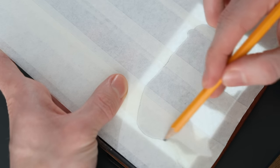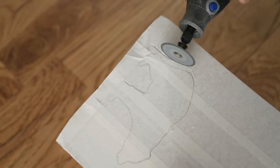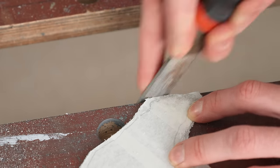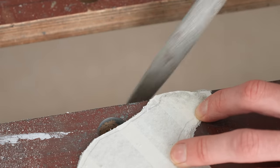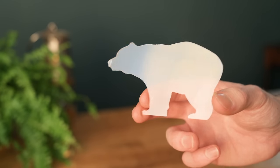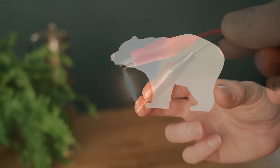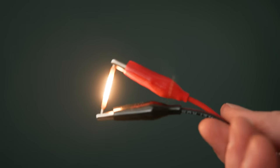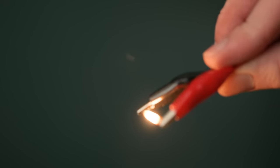As for the screen's acrylic back panel, well this is where you can get really creative. For this, cover the sheet in masking tape on both sides and then trace a pattern or shape onto it. Now roughly cut around this with a rotary tool and then remove the remaining material with a file until you reach your traced line. The tape can then be peeled away leaving you with your shape.